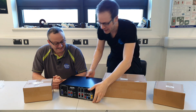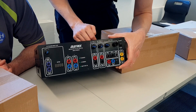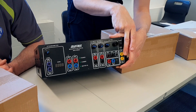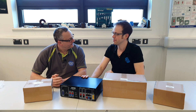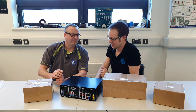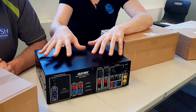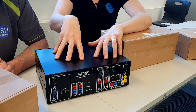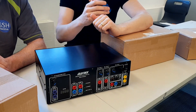Which is pretty cool in itself. There's all kinds of things you can control and monitor on here - you can look at how fast it's running the motor and lots of different things in the single phase supply down there as well. This bit here is for connecting up your split phase motors - your capacitor start induction run type thing. So we're hoping that a couple of these boxes may have a three-phase motor and a DC motor in it. One of the other fantastic things is this is not just a standalone kit - you can actually connect this up to your PC with some software that's freely downloadable from the Matrix website, and you can monitor how your motors are behaving via software on your PC, plot graphs and all sorts of stuff.